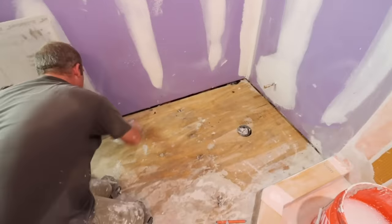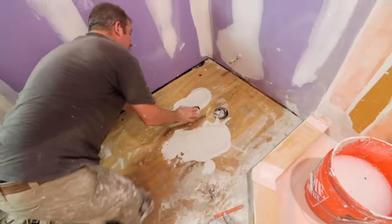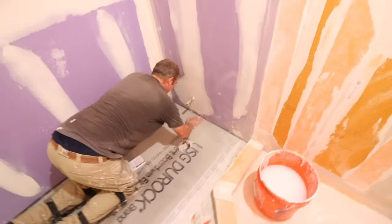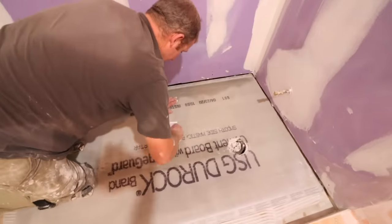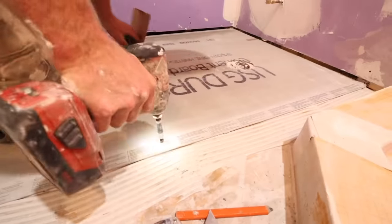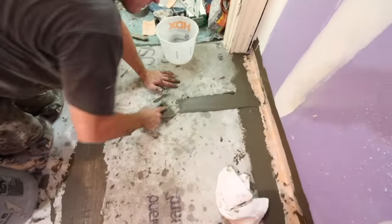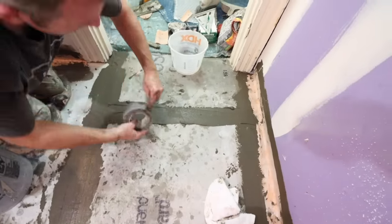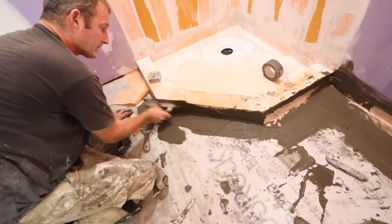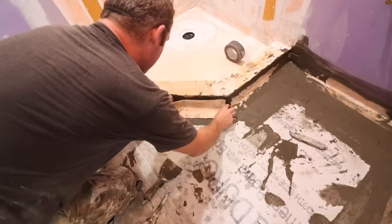A second method is to dampen the wood subfloor, then use a quarter-inch by quarter-inch square notch trowel to apply modified thinset over top of it, and then bond your Durock to that. You need to leave a gap at any change of plane like at your walls, and then again use your alkali-resistant screws every six inches. In this case we're using Speedset to speed up this installation, applying that to all the seams, adding our alkali-resistant mesh to that, and then you can use something like KERDI-BAND up against your shower and your drywall to make sure that all these changes of plane are in fact waterproof.